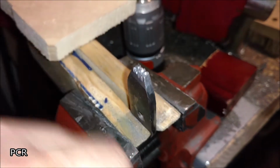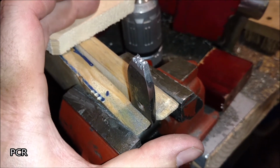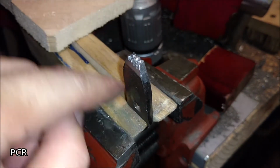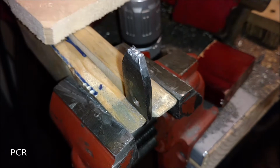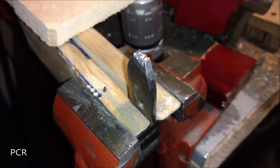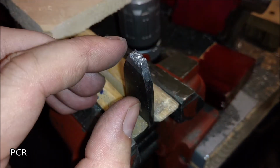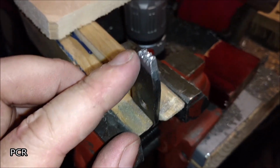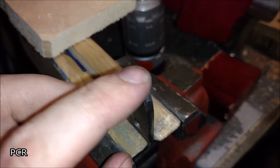and put some spray glue down, put your piece of sandpaper down on it perfectly flat, put this face down on it and rub really, really slow across it. I would recommend wet sanding in that case. If you want it where it's flawless, grains across the top of this don't show at all. I like it where it kind of shows a little bit of cross marks.